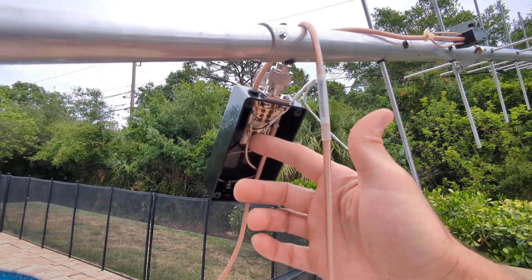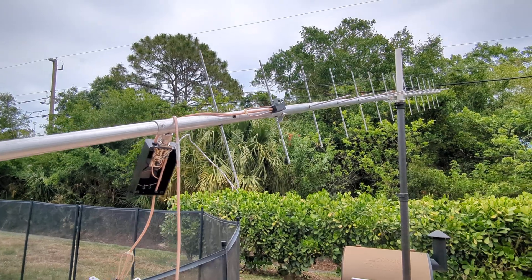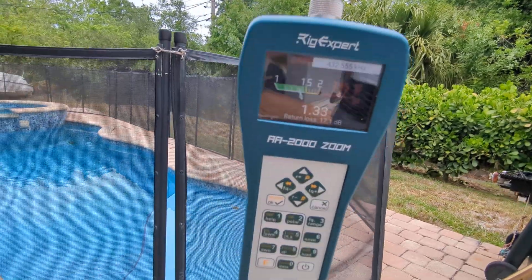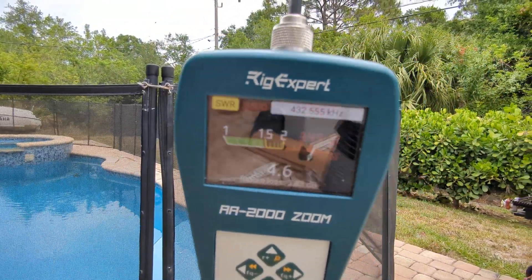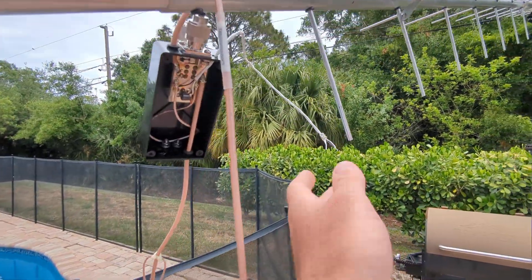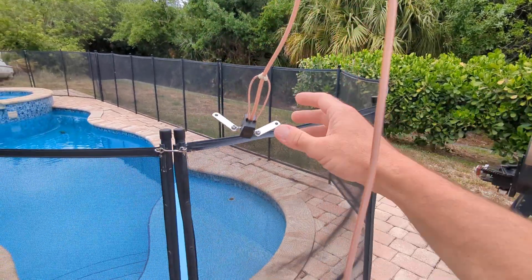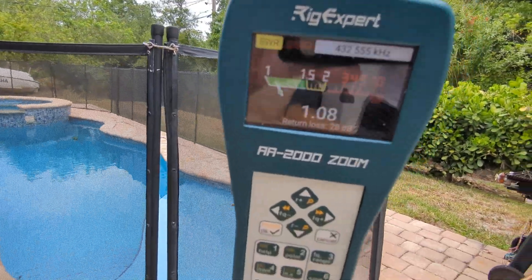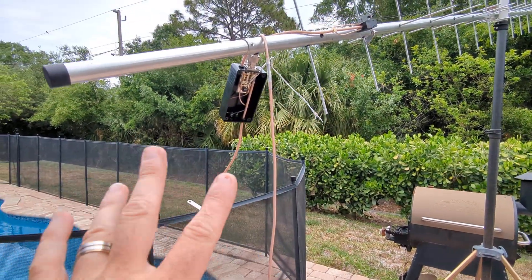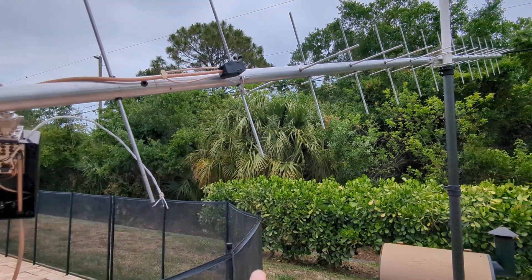I went through this morning checking the balun, trying to see if it could be wrong. I used different coax. What I found was in the unswitched position, watch — see how it throws the SWR off from touching it? Then I touched the other driven element and nothing moved. I applied 12 volts and the relay switched; that one became active and touching it had no effect on the analyzer.